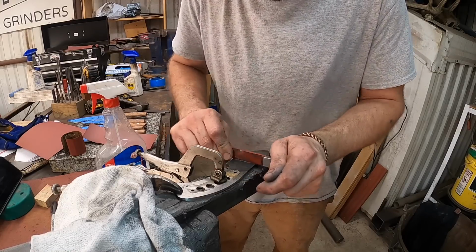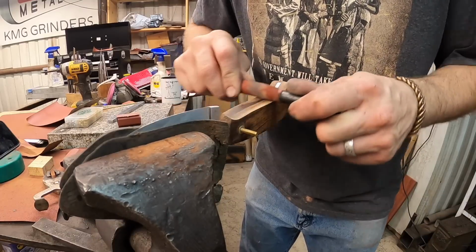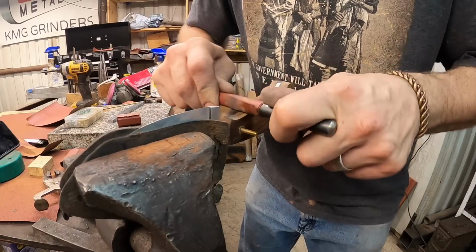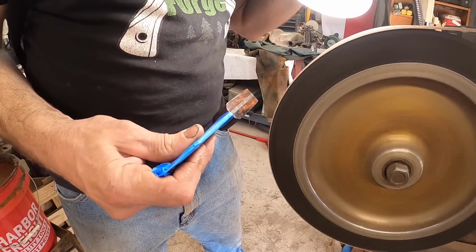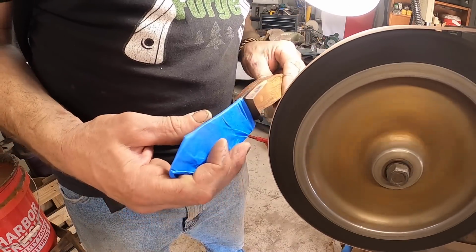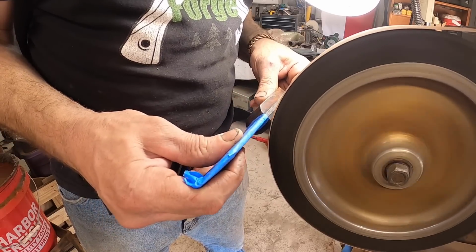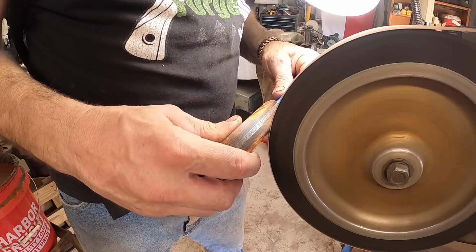Hand sanding, and then also sanding the tang to fit to the handle scales. Since I'm going to etch the tang as well, I have to finish the handle scales to what they're going to be, where they match up to the tang. I didn't show the etching process. I've done that in multiple other videos, but this is the knife I'll put together after etching. And now we can shape the handle, which must be done very carefully so we don't grind or scratch the already finished tang.